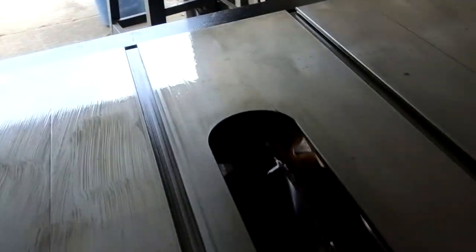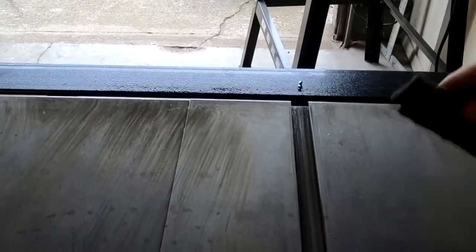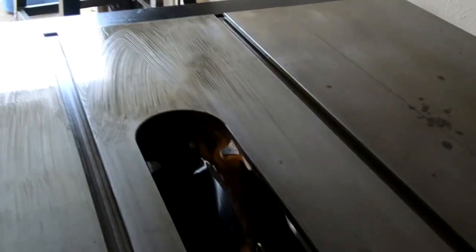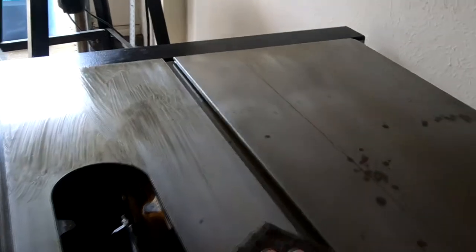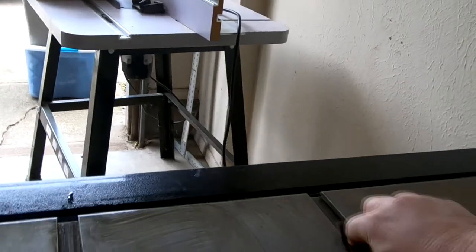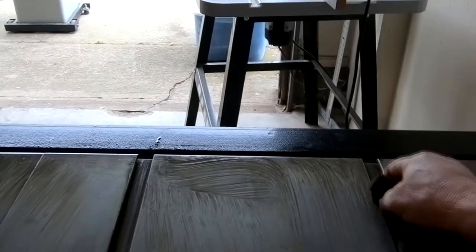When we relocate permanently to Contentment in the spring of 2020, we're going to take all of our things with us and I'll have to find temporary storage for my woodworking equipment until we get a shop built. Contentment is a much drier climate than out here in the central US — there's not a lot of humidity there except during the winter. So I think what I will do is before I store it, I will oil this top or put some kind of thick oily paste like Cosmoline on it, and then cover it with a heavy piece of plastic to seal it and protect the top really well while it's in storage.